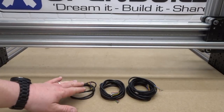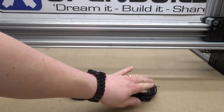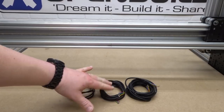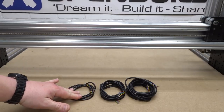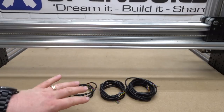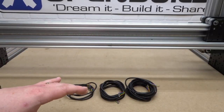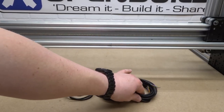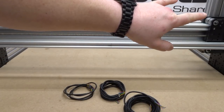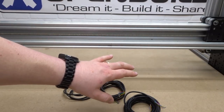We have three more four-conductor wires. The 13-foot cable goes to our Z-axis, the seven-foot goes to our X-axis, and one three-foot cable goes to our Y2 motor on the right side, opposite the Y. Let's focus on the 13-foot cable first. Since we're facing the back of the machine, we have access to our Z-axis motor, so let's turn our attention there and follow the same process we did for the Y-axis.